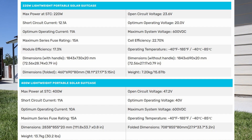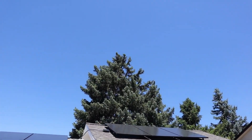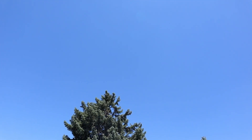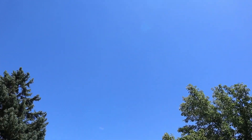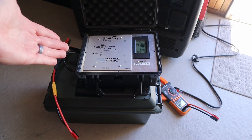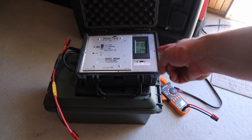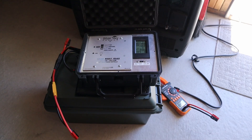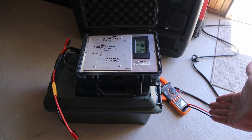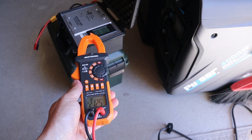On screen you'll see the rated power output for both panels — the 220 watt and the 400 watt — so we'll see how they perform versus rated output. We're right at midday, middle of summer, around 95 degrees, so these panels are going to be hot and we'll probably see a reduction in efficiency, but there are very clear skies with just a little bit of haze. We'll be testing both panels with a BlueSky MPPT solar charge controller and an inline shunt to measure voltage, amperage, and wattage, as well as open circuit voltage using a voltmeter. The panels have been sitting in the sun for about 20 minutes, so they're probably as hot as they're going to get.